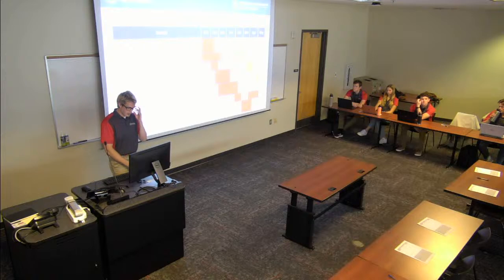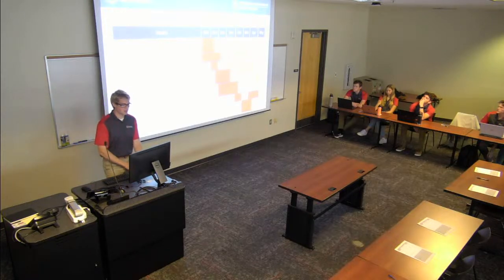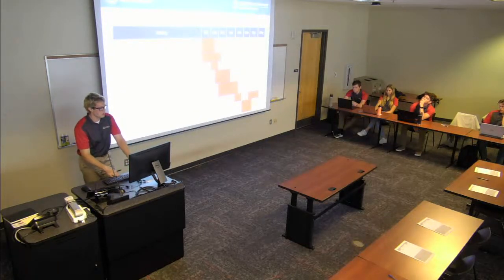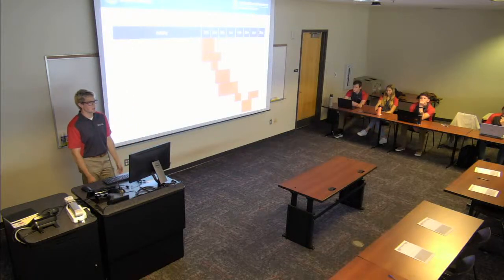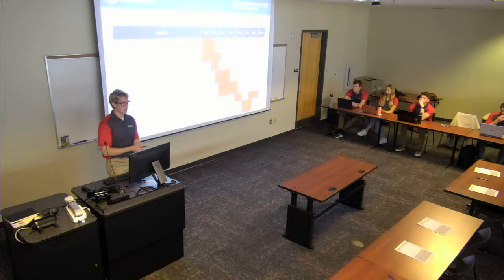Here's our schedule for the year. We've started out just with teaching newer members how to use the CFD software ANSYS Fluent. Additionally, we've started and we're moving on to nose cone research and drag analysis, just looking at a different nose cone shape. It might be beneficial to us. Transition piece analysis and adjustments. We're going to have to make very slight changes to our transition piece, the part between our body tube and motor tube, just because we are increasing our motor tube by a very small amount, up to 4 inches.